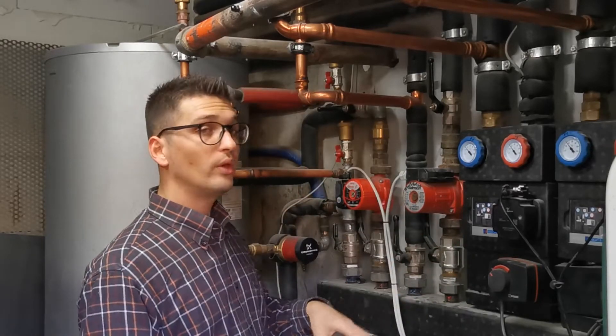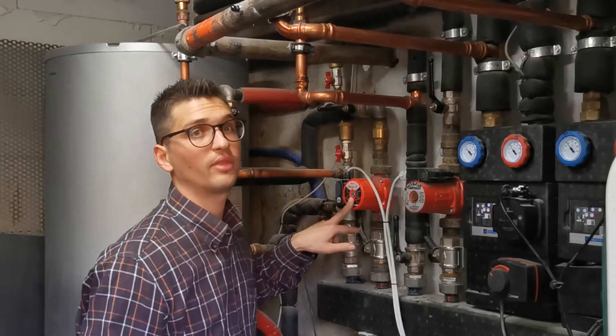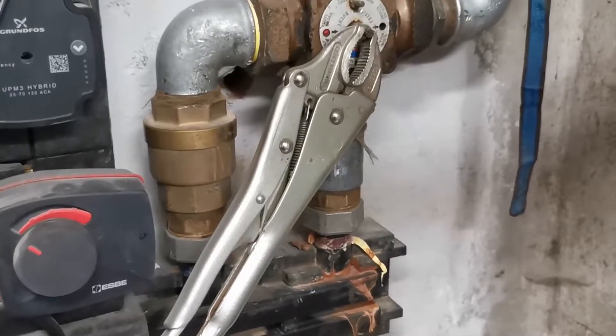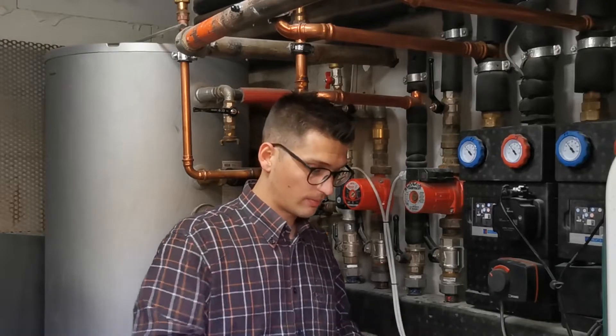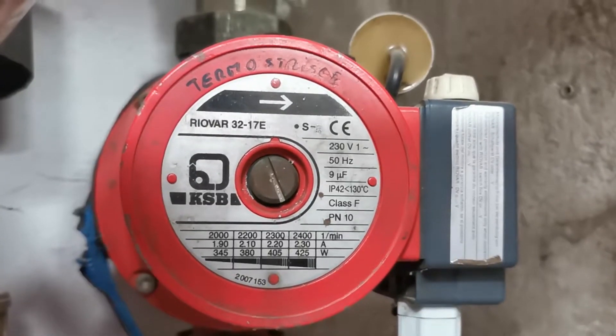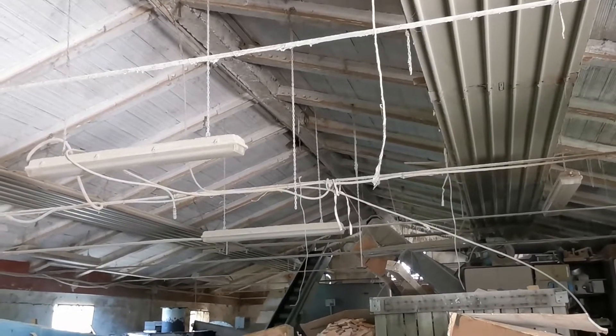The configuration here has three heating circuits: one for the factory and two for the house floors, plus a pump for the sanitary water tank. For the factory circuit, there is a big mono water mixer connected to both the hot and cold water pipes in the water collector, so that the final water temperature sent into the factory is about 50 to 60 degrees. We need it quite low because the radiant panels in the factory work at this temperature — we cannot send 80-degree water directly. The pump is quite big since the factory has two parallel lines requiring a high flow rate. In this case the pump is manually activated since there is no automatic control.